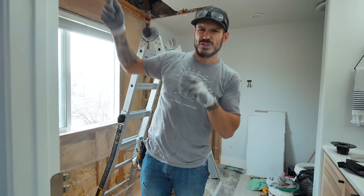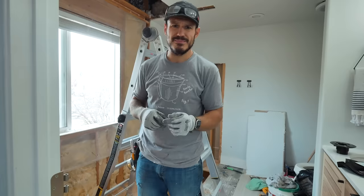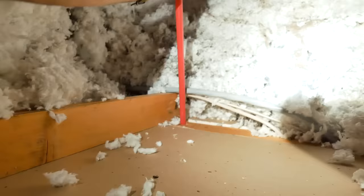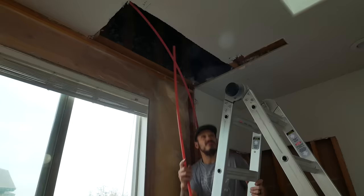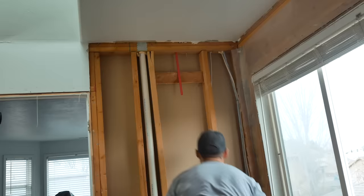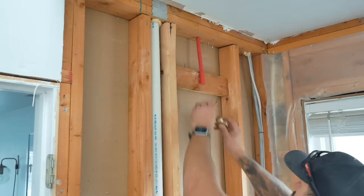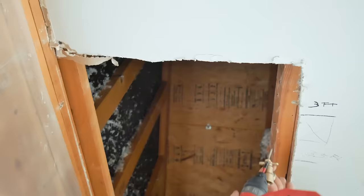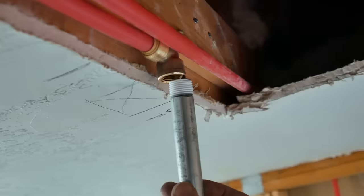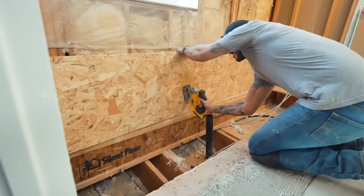Moral of the story — super simple, you can do it. When running the new water lines, I'm using half-inch PEX piping connected to a half-inch drop ear SharkBite connection, which is basically a 90-degree brass elbow that attaches to a two-by-four via screws, and will allow for a shower head to screw in when done. Since we're not ready to connect the shower heads yet, I'm using a half-inch galvanized pipe with a cap to temporarily close the water line.